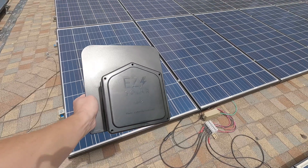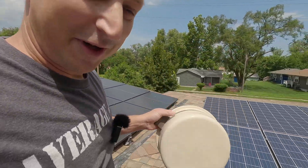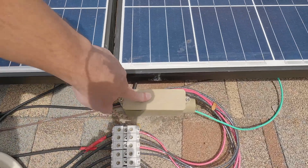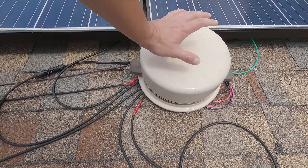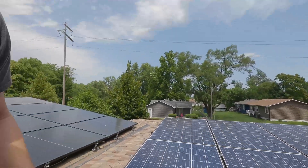That'll be my switch from PV wire to the THHN wire inside of this box. We are going to put this in another day. Not a lot's going to happen today because they are predicting some pretty big storms later on. I do need to do one last kind of janky fix for this solar panel install, at least until we get that Easy Solar box in — I need to cover up my wires right here. I don't want any water to go down into that box there since this part is temporary. I'm just going to use this old pot until I get the Easy Solar box installed.